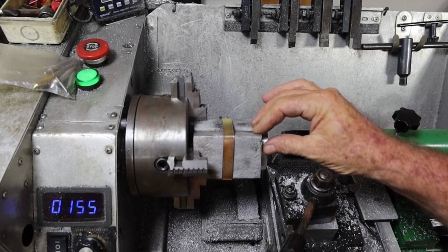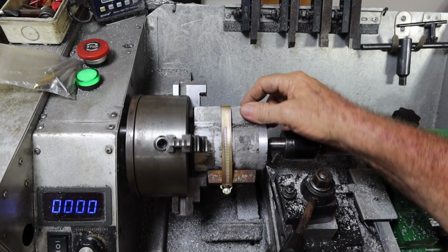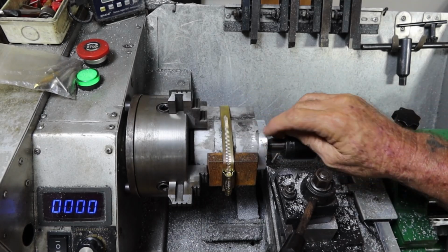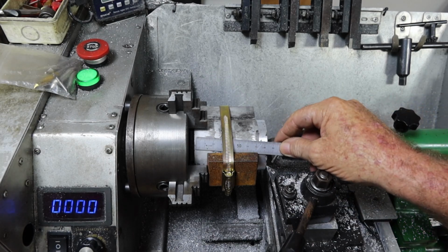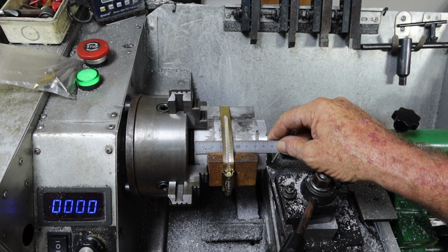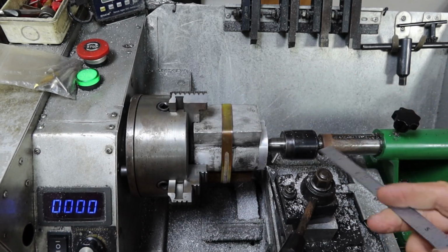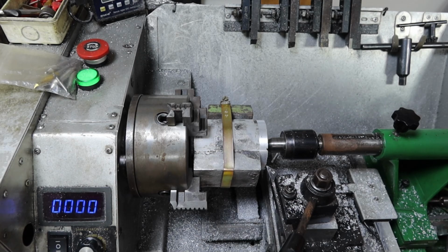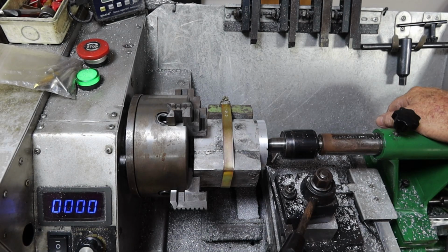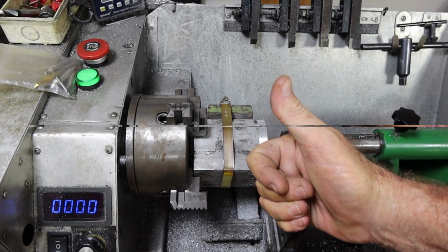Alrighty, so I've pretty much got rid of that chamfered off bit there now. And you can see here, this lightweight foam just leaves the shittiest surface finishes. What do we got here? Oh, that's 85, 75, righto. Now by rights I should probably just get the parting tool out and just part that off, but geez, I don't know if I can get in there far enough with it before I start hitting something. I might just drill it and bore it, and then once it's all bored, just machine away whatever's left.